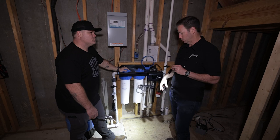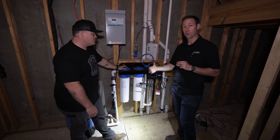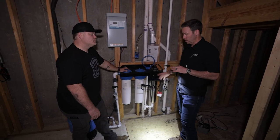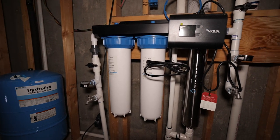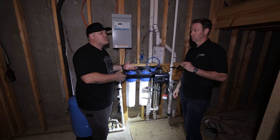They don't know what your water looks like. So it's always smart when you're finishing a project, tell your clients, hey, check them early. Don't wait for the full time. See what it looks like. And maybe you can go no problem 6 months, but maybe you actually need a 3 month cycle. When you have more people in your house, it's going to be probably shorter intervals than if you had, you know, five people versus two people.